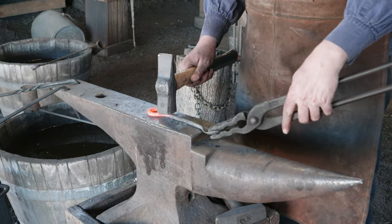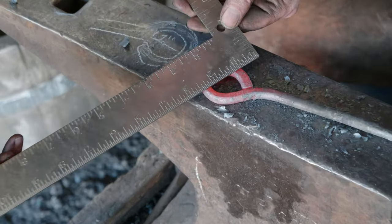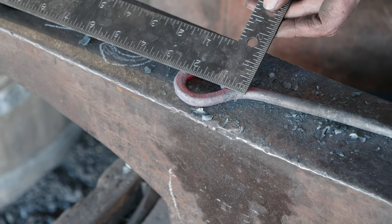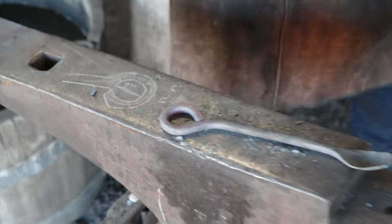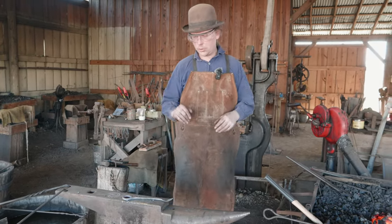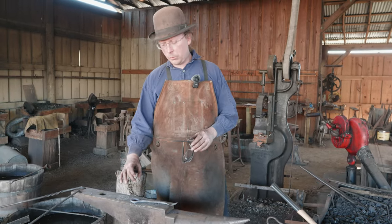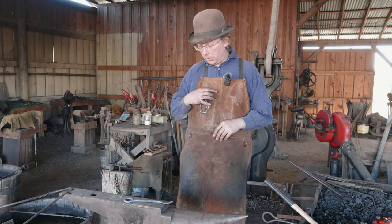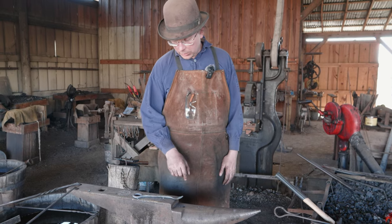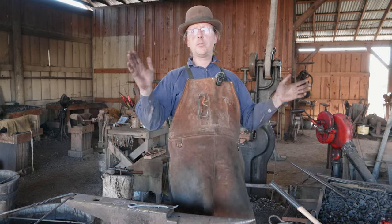Let's grab a ruler real quick and take a look at it. Right there — add an inch, it's a little long in that direction. That's okay. For these Level 1 Abana projects, the goal most instructors are going to judge you on is whether you're within a quarter inch of the specified target. So the fact that we're right on at one inch width-wise and a little long in the other direction — I don't think that is a problem at all. The final thing I'm going to do is clean up the edge of the spoon with a file, hit it on the wire wheel real quick, and we'll take a final look at it and be done with the spoon project and our introduction to forge welding.